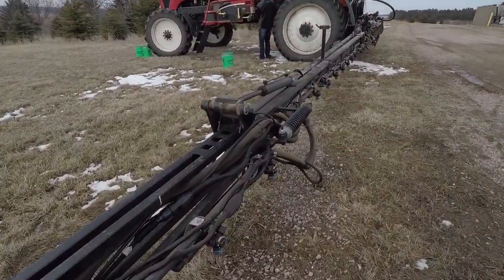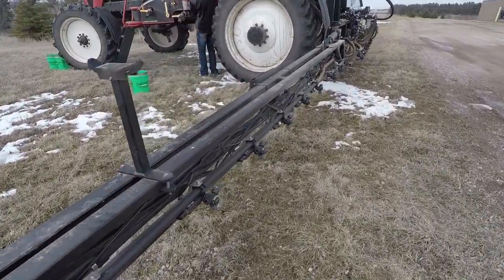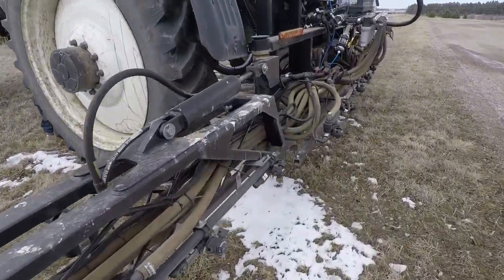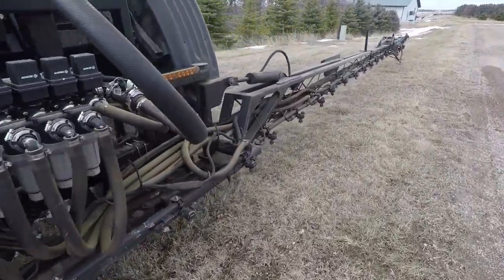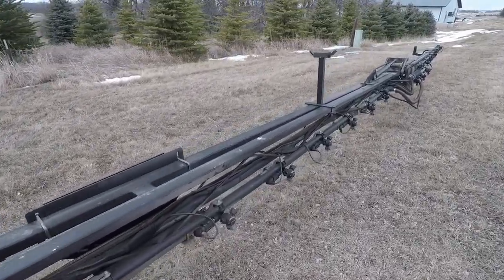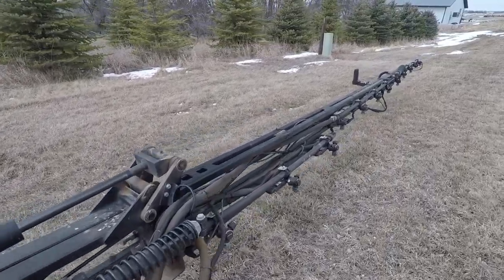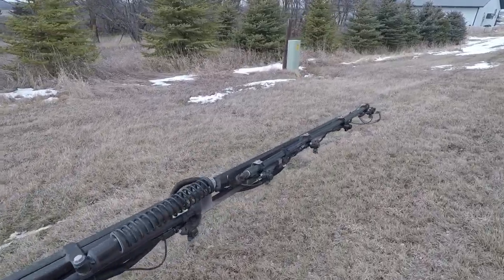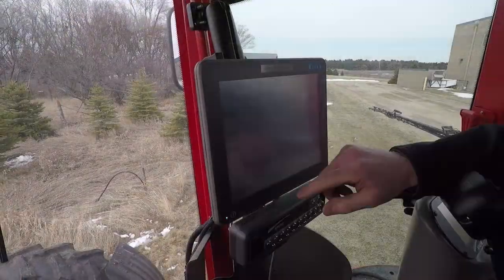Down toward one side of the boom, we want to be looking at the plumbing. Especially at the beginning of the year, make sure all your delivery system is still in check - make sure all the tubes, make sure we don't have any cracked fittings. If you had the system pressurized, you could make sure there are no leaks anywhere. There are a lot of banjo fittings that have seals which over time could deteriorate. Mainly checking the hosing and tubes for cracks, and make sure that once pressurized we're not going to have any issues.